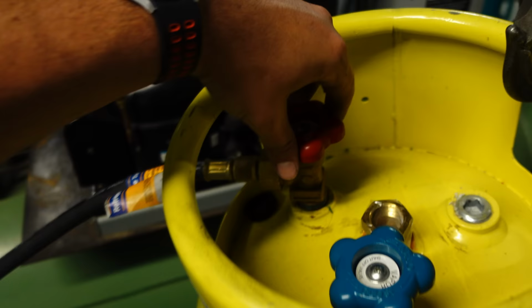Now, I can close this valve, and I immediately start pulling down on my suction side. I'm down into the negatives there. And then I can close my liquid valve, and my liquid valve is cold, which would indicate to me that we're flowing through there some kind of liquid. But I don't understand why we're not still pulling more into the tank. But I can close this valve, and I will start to decrease on the suction input. And we've just got a ball valve down here flowing, and this whole line is cold, which, again, all that indicates to me that we should have some kind of flow.